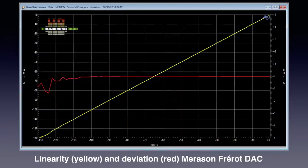Centrally placed are two clock crystals specified at -95 dBc/Hz at 100 Hz, which is nice for this class of equipment. The more popular specification is 100 to 300 femtoseconds depending on the measured band. Input selection and AES-3 interfacing is handled by an AKM chip. I measured linearity and found that even down to -120 dB the deviation is less than half a dB, which is great. The impact on sound quality is limited though — I've heard DACs with far less perfect linearity that also sounded fine. Time integrity, something very hard to measure, is far more important.